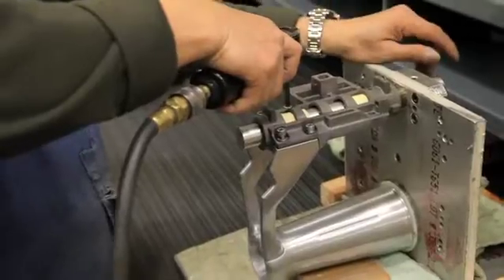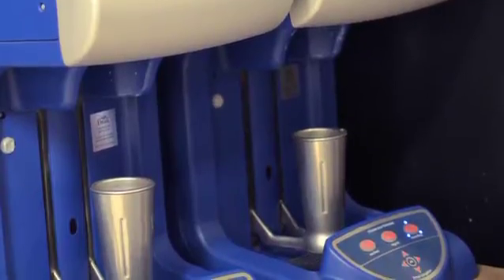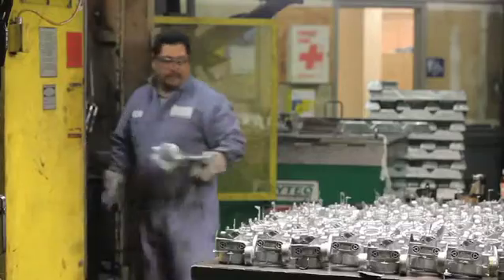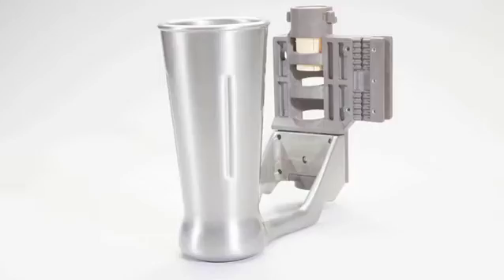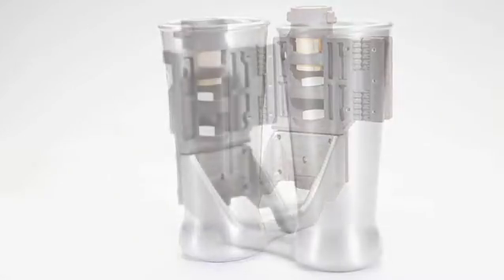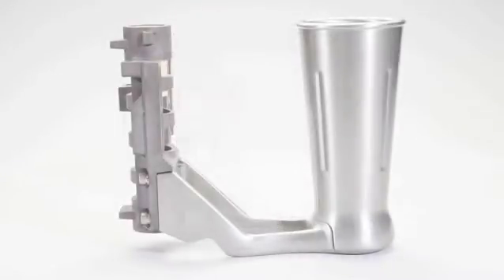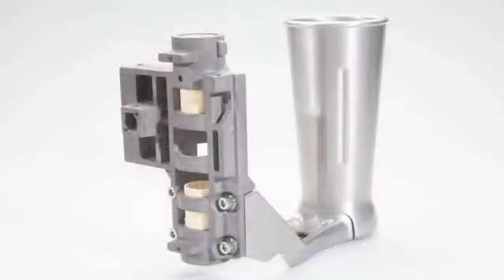Once we got into production, For Real had chosen a really nice looking metallic powder coating finish, but what we found was that this powder was not compatible with the die casting process. We had to pursue other alternatives. In our investigations we came across a ceramic coating, and as it turned out, the ceramic over the brushed die casting ended up being a much more favorable finish.